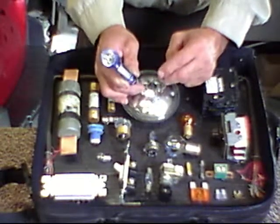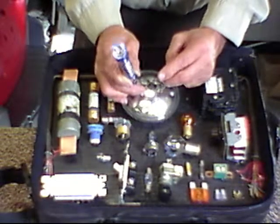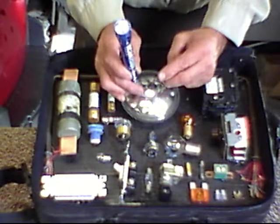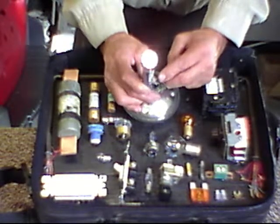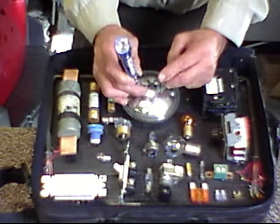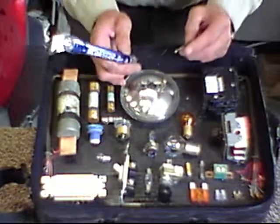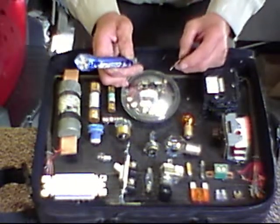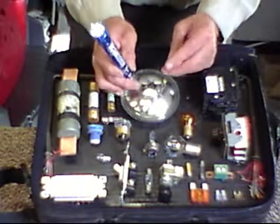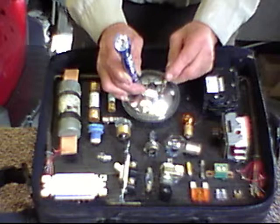If you see that right here I'm touching the nut and this contact and that's not lighting up, what's happened here is there's some corrosion underneath this screw. It's really a good bulb. I can tell that it's a good bulb when I touch here, but when I touch here it doesn't light up. Chances are if I unscrewed that screw and put a wire under it, that would make it work and it would be okay. But it's really amazing to me that Megatester can pin that down. That screw would not work.